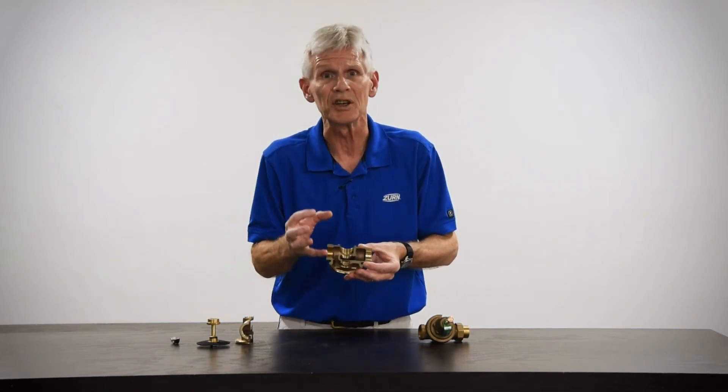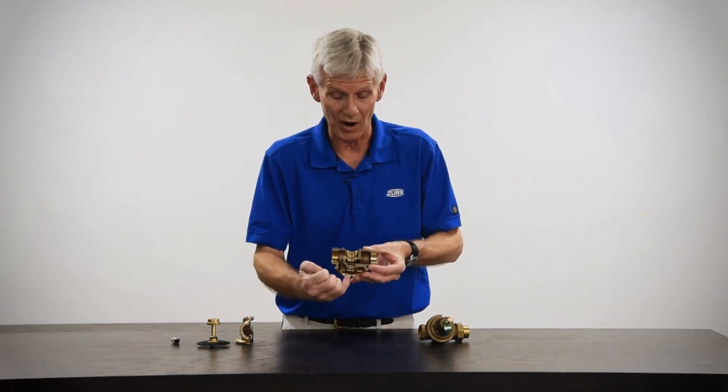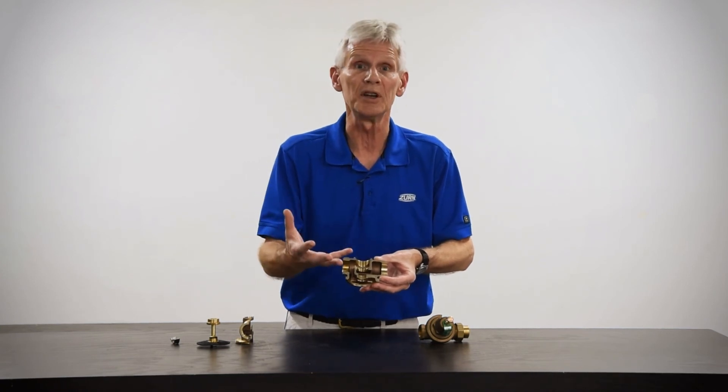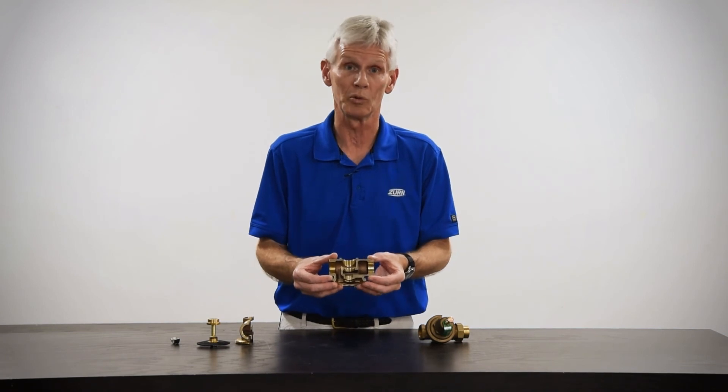With respect to any other component in the valve, there really isn't anything else that could cause the valve not to work when you repair it. So again, just be very cautious about your O-ring bore. Once you find that it's good and clean, or you've cleaned it up and there's no pitting, put your parts in there and I can assure you your rebuild will be very effective.